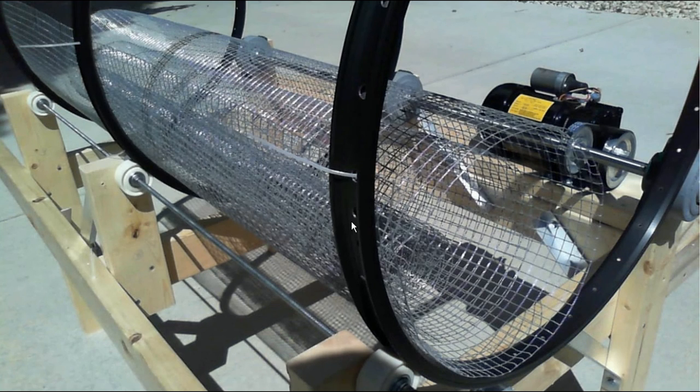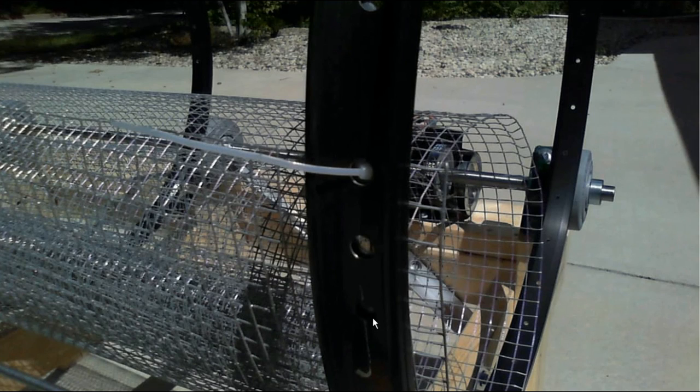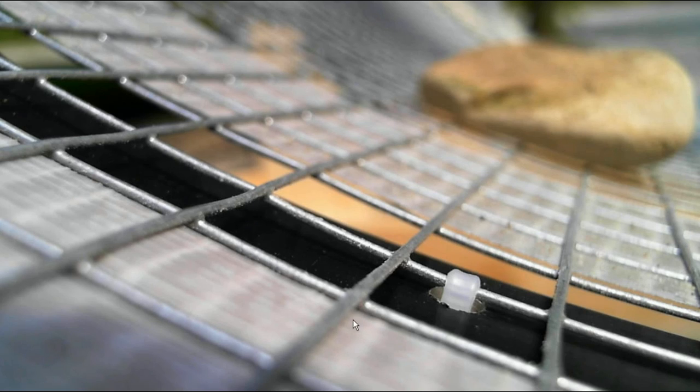As you begin the process of tying the hardware cloth to the rims, you're going to use your drive wheels to rotate the rim up to the next available spoke hole so you can secure it on the upper side of the idle wheel. This will ensure that once you've made all the ties in the spoke holes, your trommel drum will be perfectly round. This is a close-up view showing the tie strap wrapping around the vertical wire. You'll also notice that the horizontal wires are on the inside of the drum — this causes the rocks to tumble.